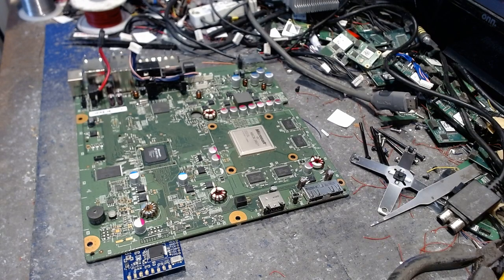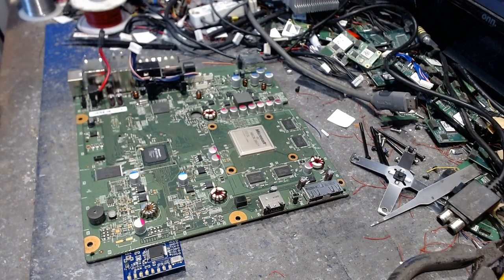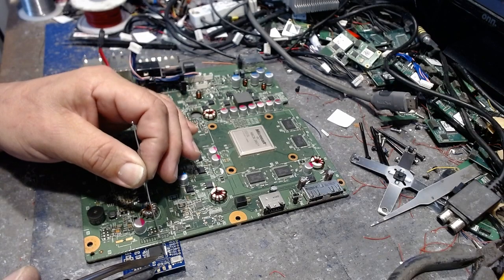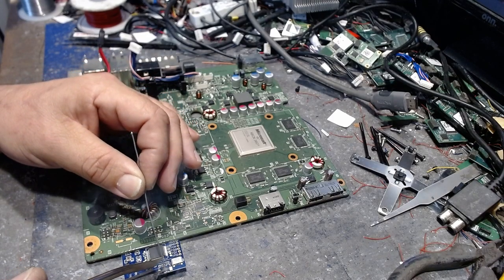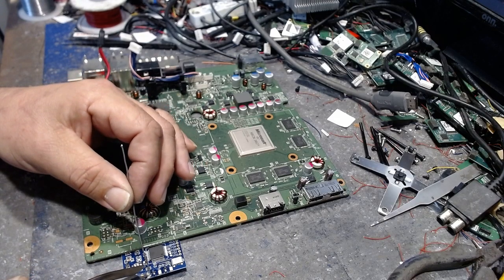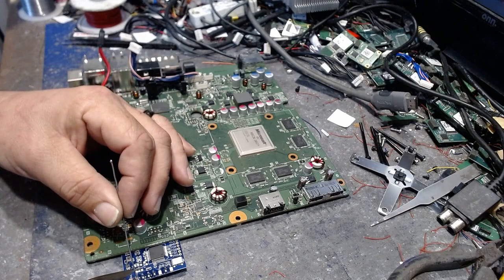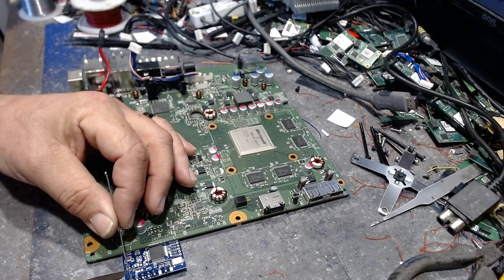Okay, so anyway, as you can see, I got a Trinity board, you know, stripped out. Okay, there it is. I already got it pre-fluxed. So what we're going to do is take our trusty soldering iron right here, and we're going to go ahead and pre-tin all of these. That way they're done, so I don't have to worry about that. There we go. There we are. Very cool.